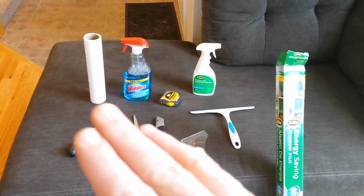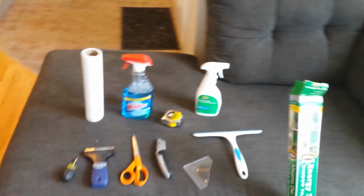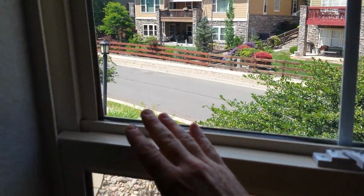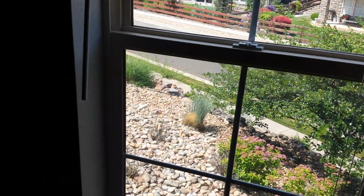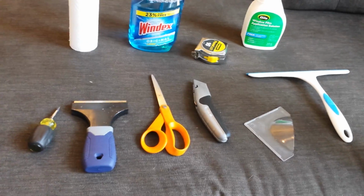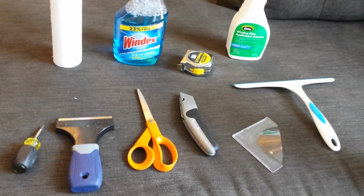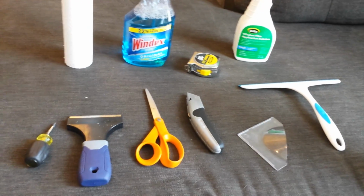Okay. So what you're going to do is, usually I do about 3 Windexes. You're going to just do a normal Windex like you would. The next thing I usually do is I Windex all of the sides to make sure that it's not going to pick up any dirt from the surrounding areas. And the last one I do is I use this razor knife as an etcher. So I just etch off any paint or microscopic particles of dust and dirt. That will also help prepare the glass, get more of the micro cracks available for the film to adhere.